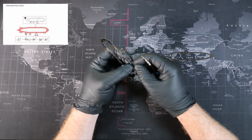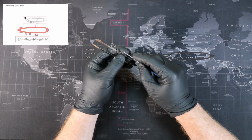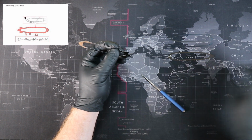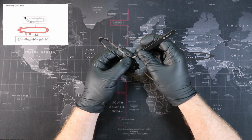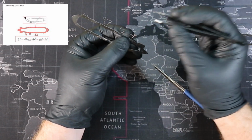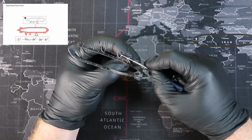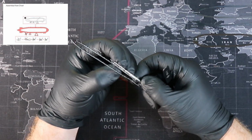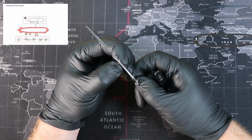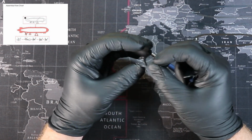This is kind of hard, though, again, with this propeller here. So I'm going to try to bend that out of the way. And I think it's my second step here, and I'm going to use my tweezers to help me with this. I'm going to get this bend started here. What I'm doing is just getting a couple bends in there to help me get started. And then when I bring my tool up here, I start manhandling it like I am right now. It makes it a little easier for me to get the pieces where I want them. I'm just trying not to warp any other parts of the metal. It's kind of a tricky maneuver to do, especially with how that piece is.